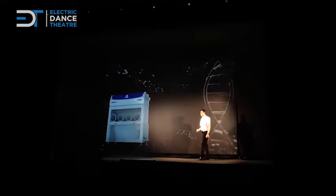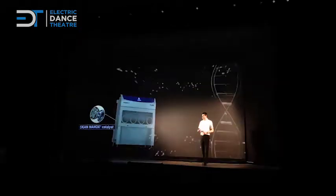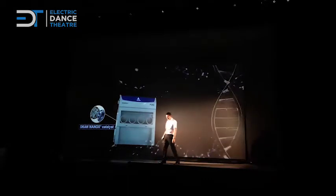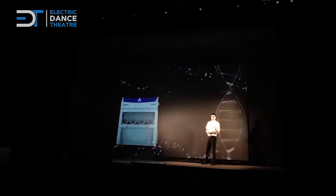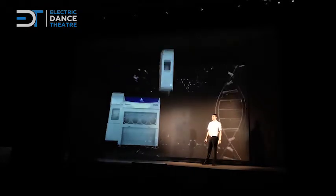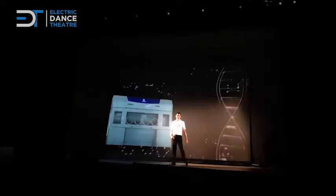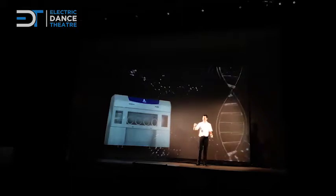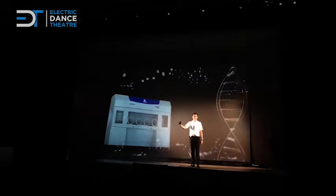The next feature, also very important for the challenges I was explaining before: the filter. And that's a good thing — the configuration. If you look at this, you see here a four-glove isolator. You can have it in two gloves, a little smaller. And you can have it with airlocks. So you can decide to keep it just as the isolator, or you need one airlock, or two airlocks. They work the same way — decontamination, everything. But you can now introduce material inside and out of the isolator by decontaminating it with the hydrogen peroxide.